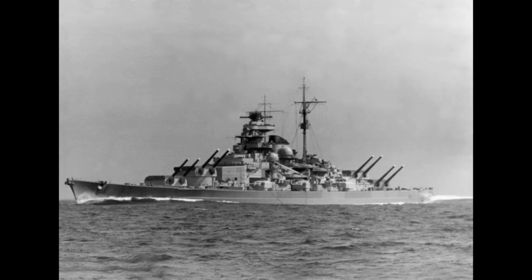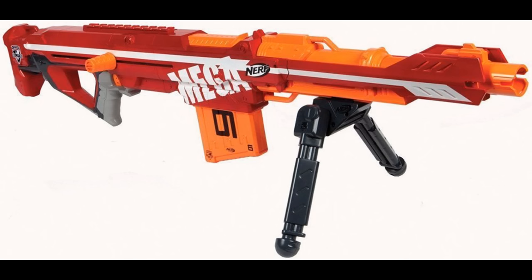An ultra-stable ship wants to pop back upright as fast as possible. In relatively flat seas this is fine — small waves induce virtually no roll, so you have excellent gunnery. But the minute you get into significantly rough seas that are capable of pitching and rolling your vessel, the ship is going to snap back to vertical as quickly as it possibly can. This is actually very bad because it's going to snap your ship around rather than gently correcting it, throwing your gunnery off really badly.